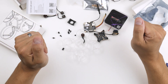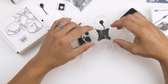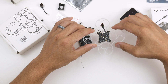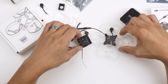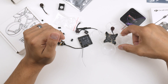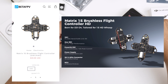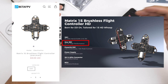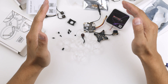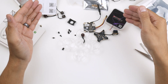Just as I was editing this video, I saw a post from Albert Kim showing he'd tried this on a 1S quad. His flight controller had a 5V 2A BEC and it was still browning out when flying, so he didn't recommend it. I'm still going to experiment anyway. I've also ordered the BetaFPV Matrix 3-in-1 flight controller, rated at 5 volts 3 amps, which should be able to power this air unit. If you want to see the next videos in this series, please subscribe below - hope to see you there, cheers!